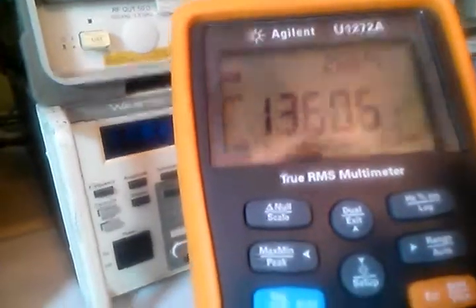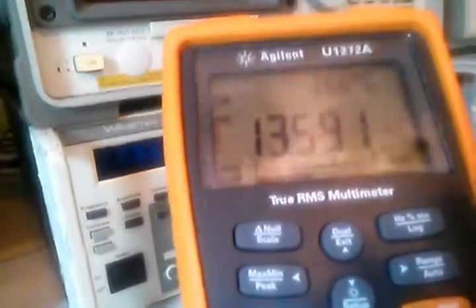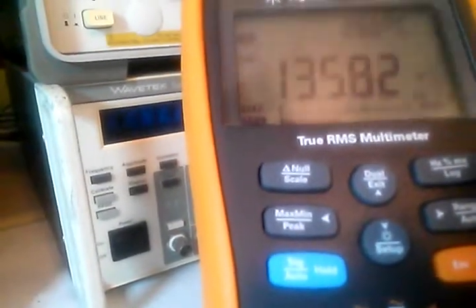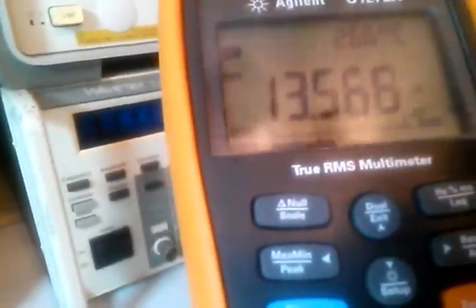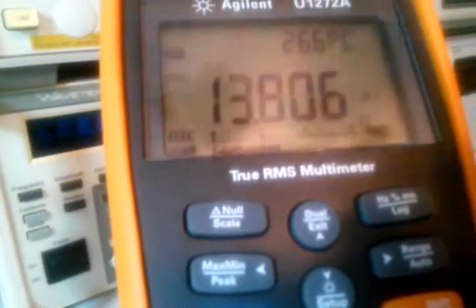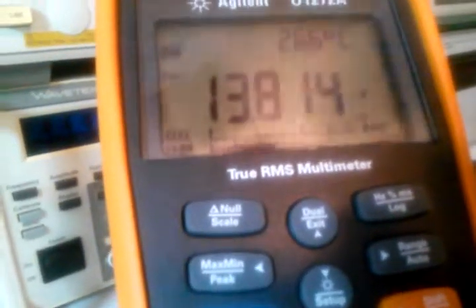It's about 200 millivolts difference, which is good enough. The reason it's not regulating perfectly is heat issues — the chip is dead cold when it's off, so there's only minimal draw for standby power. I have it heatsunk to the chassis and it dissipates quite a lot of heat, so you get some regulation drift with temperature. When it's on it's dialed in, and when it's off it goes to about 13.8 volts — really good enough. This is a thermal issue with the particular TL regulator I'm using, I think it's a TL63-something.